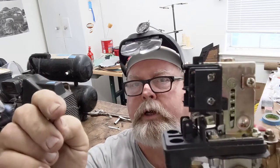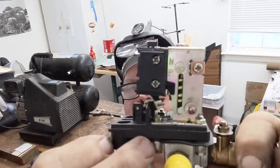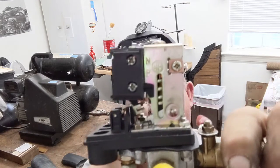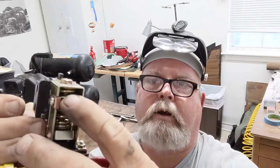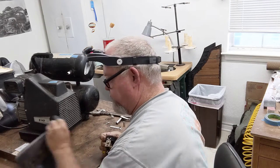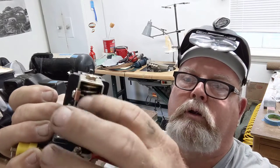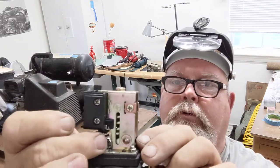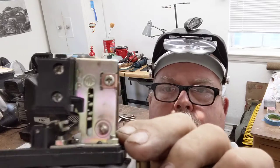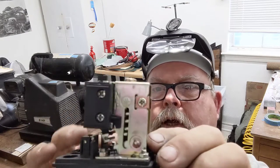When you get this off, before you take these bolts loose — they're tiny, about seven millimeter — you need to pry this up and trap it back here. You can back off the spring tension all you want, but this is a tough spring. I cut a piece of ABS plastic an inch and a half long. Once I got this compressed with the lever horizontal and this part flat, then you take the bolts out.